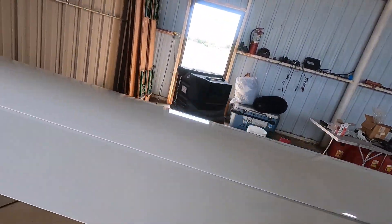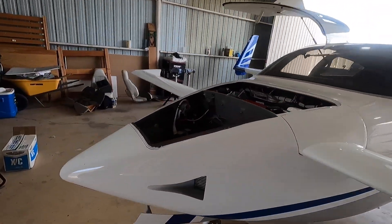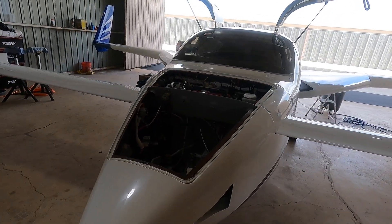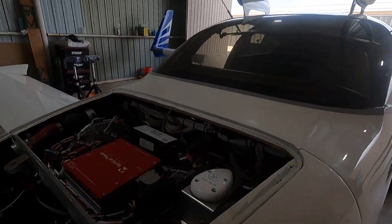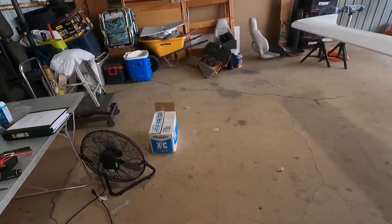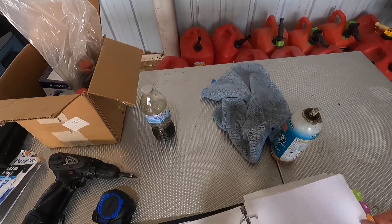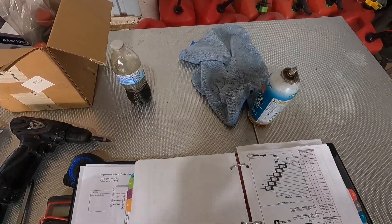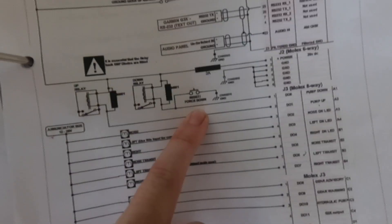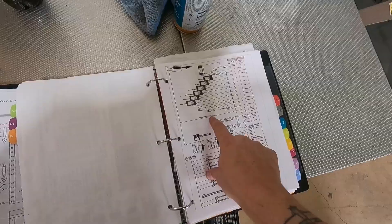This is frustrating because it is experimental and because it has been modified. It doesn't have a traditional maintenance manual or something you would follow. It's unlike any other Velocity — or really any other airplane I traditionally work on — because it has a landing gear controller in here. Because of that, you end up having to follow the wiring diagrams. This is the wiring diagram for the landing gear controller, and it has things like a reset, force down, or this ground gear up enable switch. But the problem is this wiring diagram doesn't tell me where that ground gear up enable switch is.